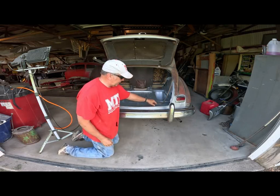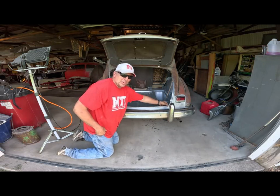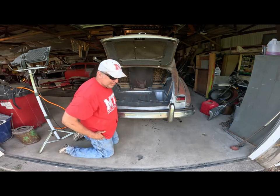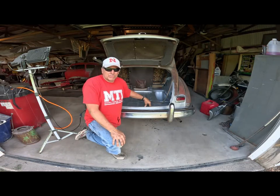And then finally the third one was the top one here. Again, cut it out with the plasma cutter, about nine-sixteenths inch wide steel, and weld that in. We're talking a lot of welding here. I used air — put air to it. The compressor was working overtime. About every five spot welds you blow it down to keep the metal from warping, keep the heat under control. And it turned out pretty good. I was happy with that. So this was the most difficult edge.